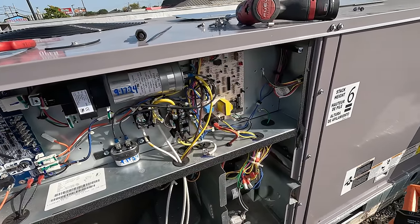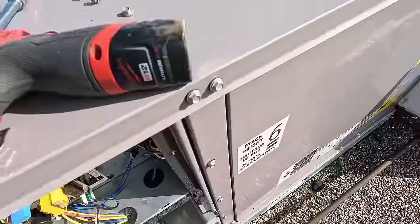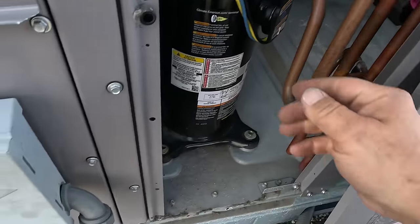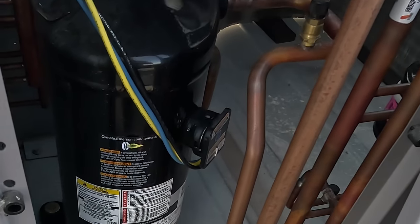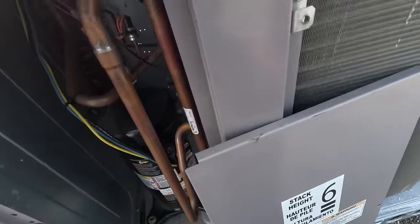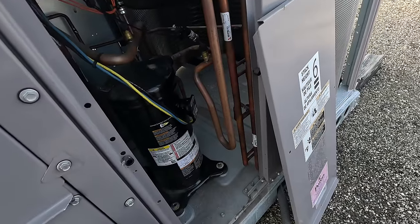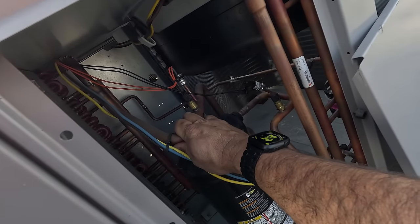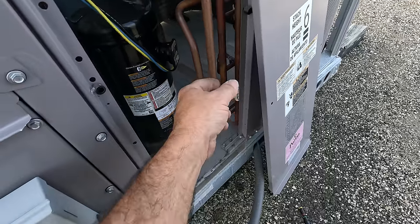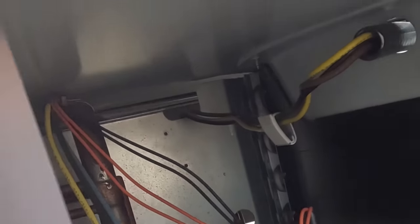So we checked low voltage, we made sure — wow, that's starting to rust out already. Well, this place is a dry cleaning place so they've got a lot of nasty chemicals in here and it will eat that stuff up in a heartbeat. Oh look at that — that is not pushed in all the way, that kind of sucks. Got her nice and tight though, holy cow. Let's see if we can pound that back on a little harder and further — there we go. See, we could have walked away from that and it would have burned it off eventually. Suction's not super cold or anything — it's cold, but not really impressive. Make sure our cap's tight on that, nothing's vibrating into anything. You've got a before and after port for the filter dryer — that's kind of new.